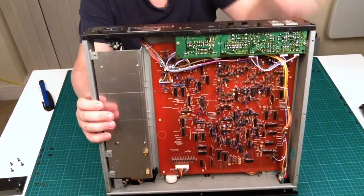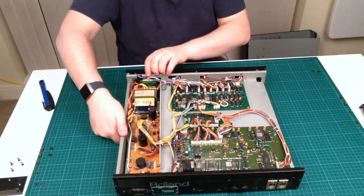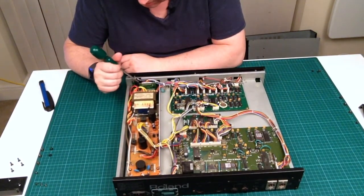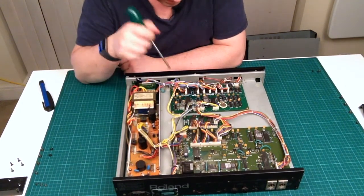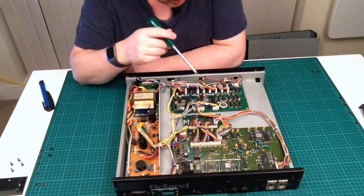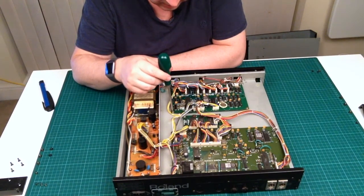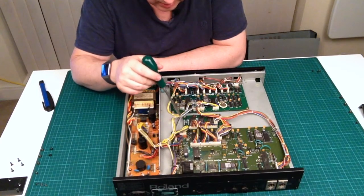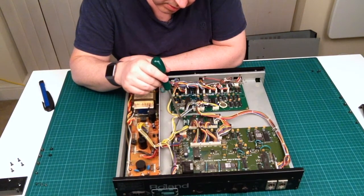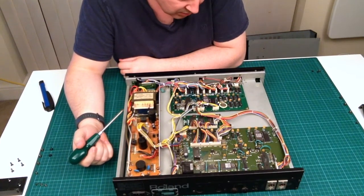And then if we turn it over like so, so you're looking at this, obviously this board here is the data cartridge interface. There is this front board here which is where the battery is, so there's some sort of logic and volatile circuitry there by the looks of it. I'm not going to take this to pieces any further. Then there's this board in the middle here which just has an RD-1000 assembly written on it, and 3 Roland chips.